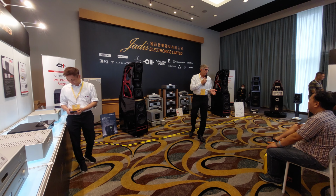When we play an analog player, here's a stylus, this is a cartridge, and this is the tonearm. Following the groove, the stylus moves like this. But if the tonearm moves together, then you never know which sound you are listening to. So this hysteresis brake, the magnetic brake inside, tries to prevent this too much movement.